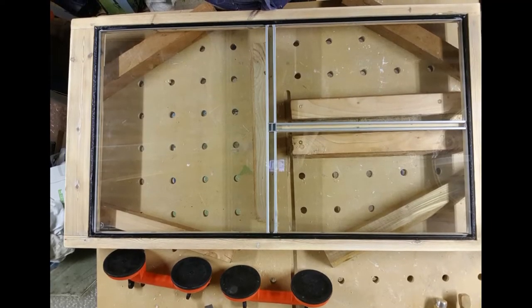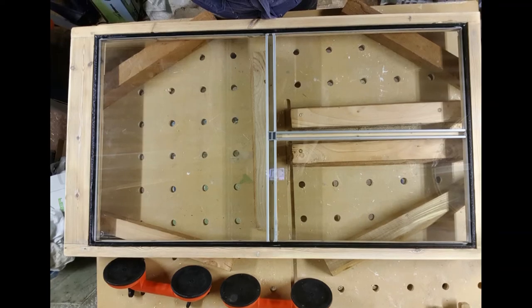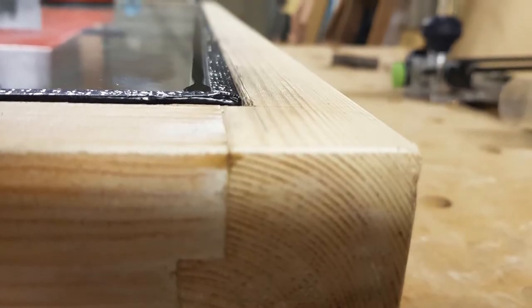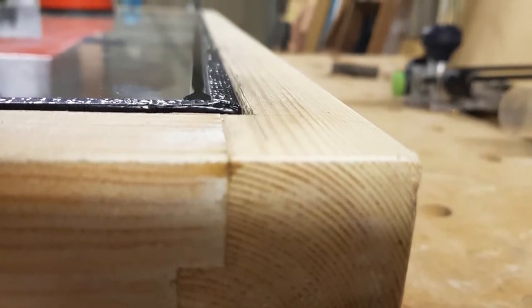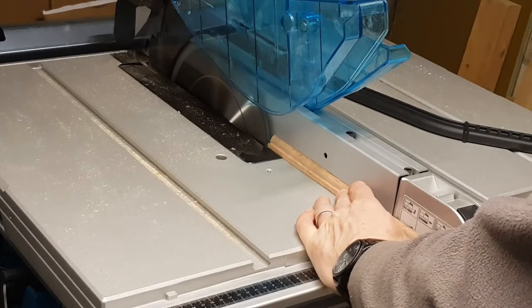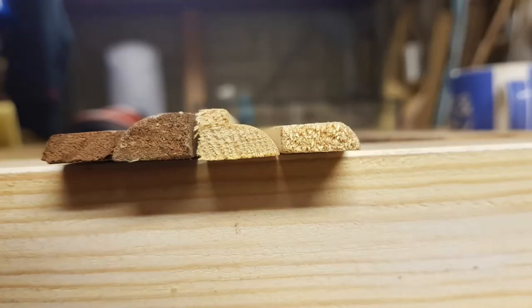The glass seems to fit a treat. If you're struggling with wood dimensions and thicknesses of glass, you can remove the black tape from around the outside of the glazed unit — this gives you about an extra millimetre in both directions. Once the frame has been cut to the correct depth for the glass you can start concentrating on the beading. The thickness of the glass and the wood you have to play with will determine what shape and size of beading is required.